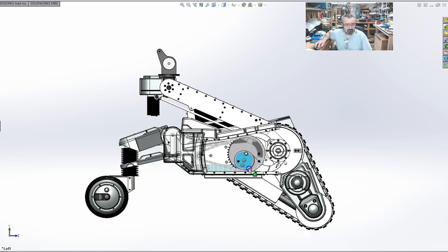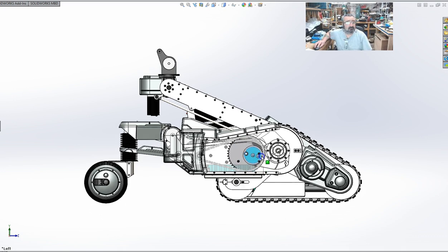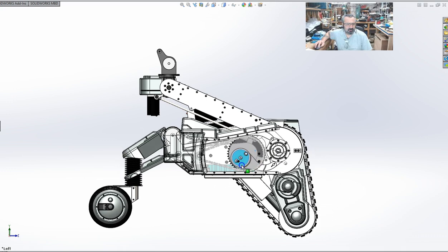As with linear actuators, if there's an issue, bad things happen pretty much instantaneously. You're going to break a bunch of stuff, and there are so many forces involved that you could potentially just rip the cradle base in half. There's that much force. So trust me, bad things can and will happen with linear actuators. That's the way this works. This is the eccentric motion here.